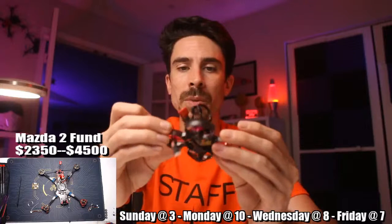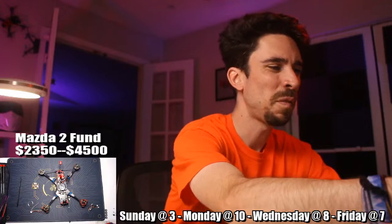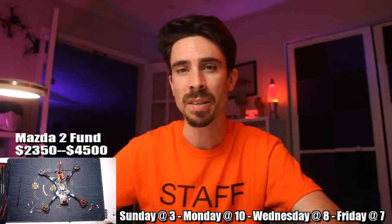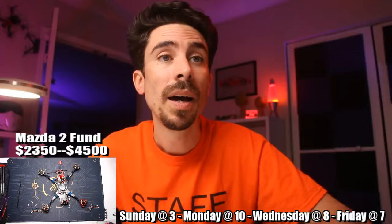And I just don't like the way that they fly without a really jacked up tune. They're just kind of floppy, and you're trying to fly them indoors where there's a million things to hit. So having a really dialed in tune, getting those P gains up into like the 90s, 100s, 110s, really makes a huge difference for me. There might be better pilots that are able to fly with a shittier tune, but I'm not one of them. And that's okay.